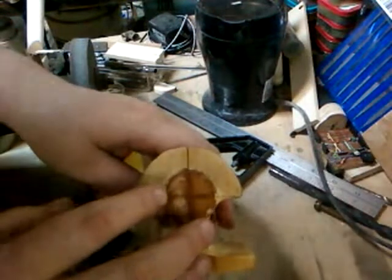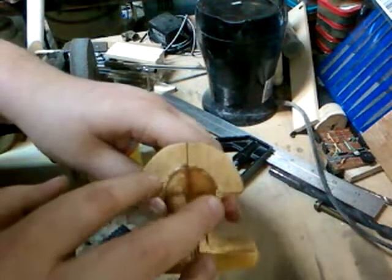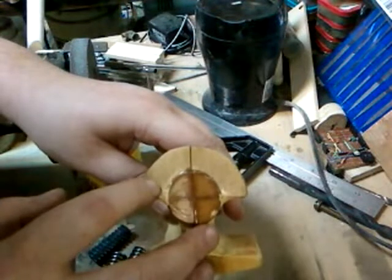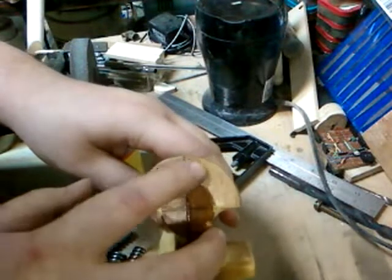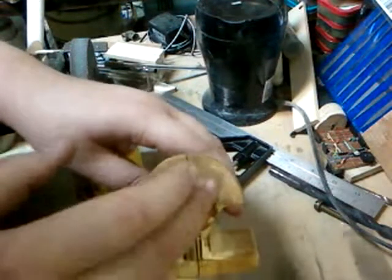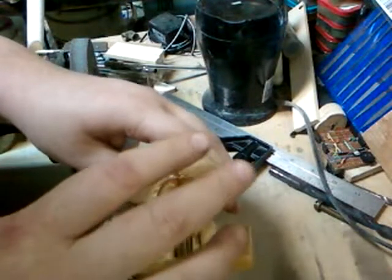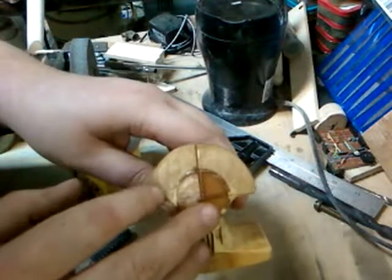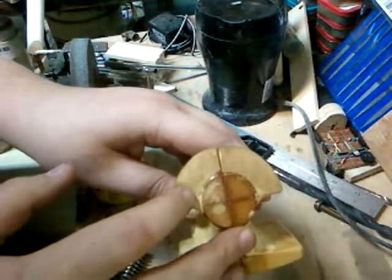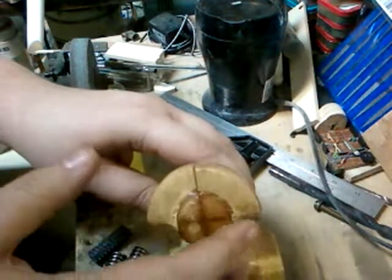The way these work: they usually have eleven holes on here, labeled zero through nine. They are eleven degrees apart, and a disc on here goes that is ten degrees apart and has thirty-six holes. When you take an index, you'll use the eleven-degree holes. The first one is just your zero, the second is eleven, twenty-two, thirty-three, forty-four, and so on.